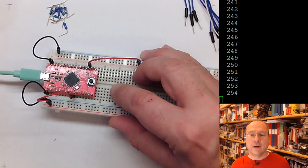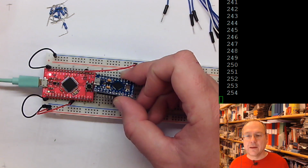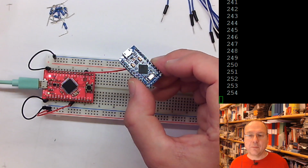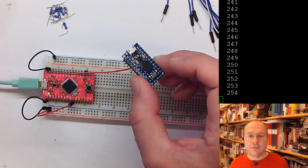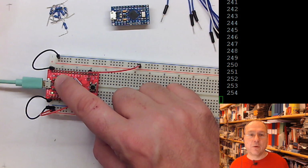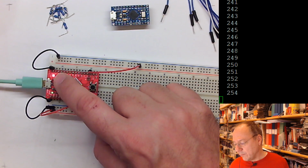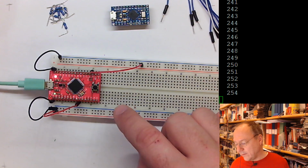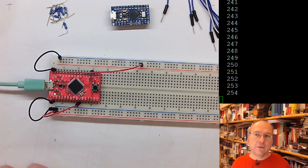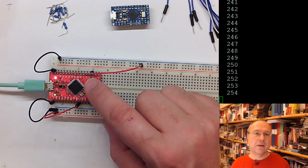The bootloader on the Leonardo and on the Micro works exactly the same as well. As long as you run the Arduino framework, there's always a piece of code checking if your host computer wants to communicate and upload new firmware. Right now, this code, which is blinking this LED in this pattern, doesn't check whether someone wants to communicate with a USB port. It only does what it should do, and this is only blink the LED. That's the way it is for this particular microcontroller. If you look at other embedded systems, for example the STM32, there you also have to put it into bootloader mode manually. There's no way to do it just by software.